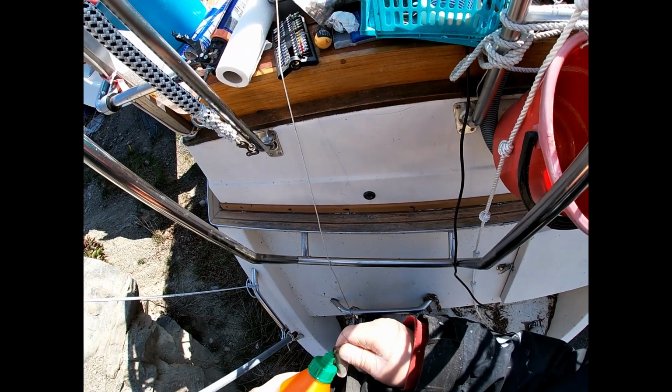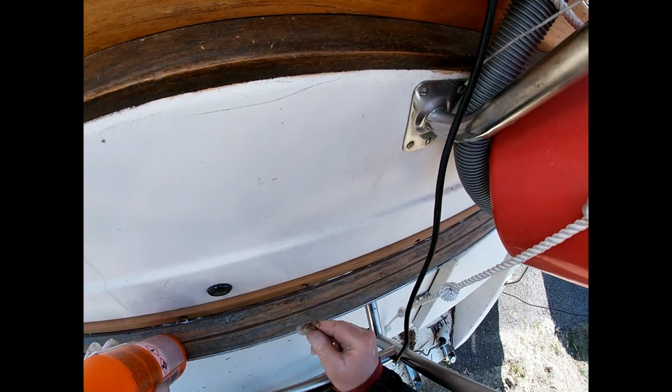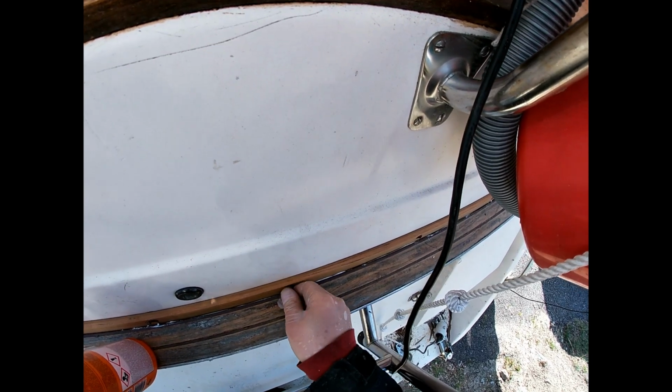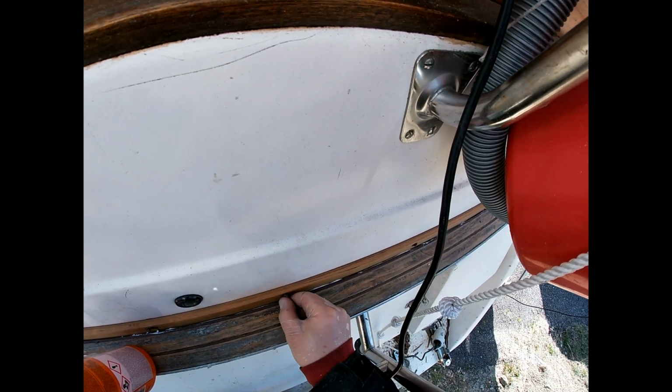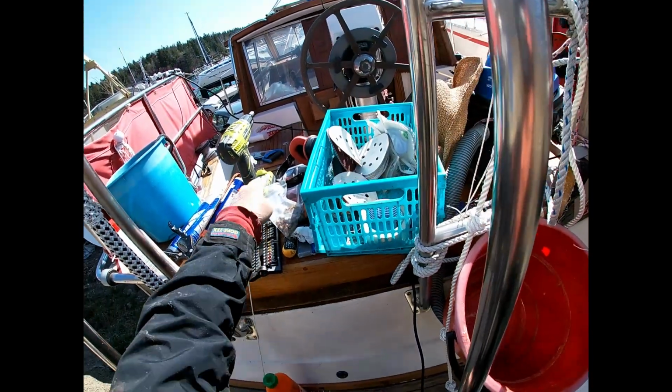And then to put all the screws in, since I'm going to put plugs in, I need to make sure the screws go far enough, so I have a couple of millimeters left in the 8mm holes I've drilled. Then I use polyurethane glue. I favor that since it's expanding, so it really gives a very good tight fit.